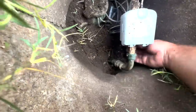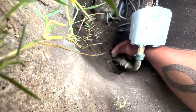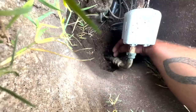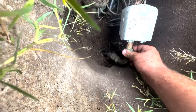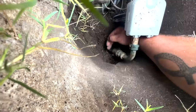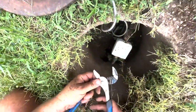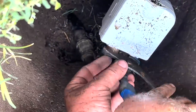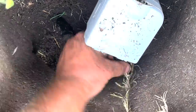Right here we have a hose clamp connection to this black pipe, and we're wanting to replace 100% of it. We could cut this off, but we just need to get it freed up and taken off right here. I'm going to see if we can take this joint apart, pull this whole thing out, put it back together with the new elbow we want to come through here, and just screw that back on. Oh yeah, this is not old because it's a new meter.